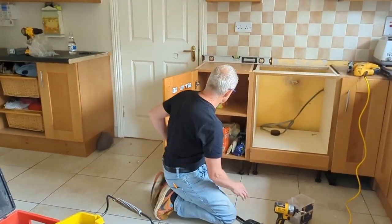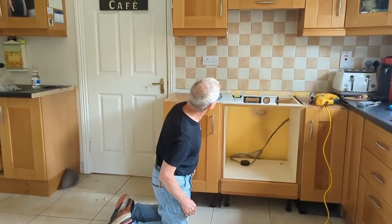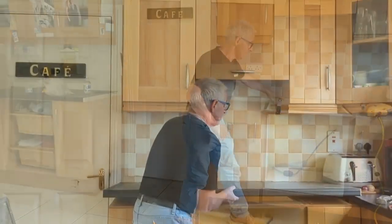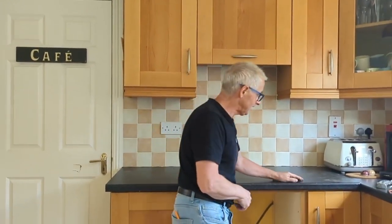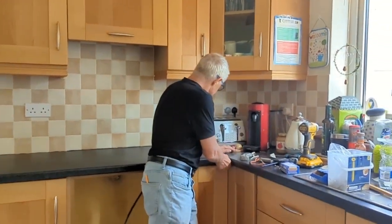That's my unit screwed together, everything's level. I'm bang on level in that direction and perfectly level in this direction — happy out with that. And I've got to push it in under the tile there, and it sits in — just about. However, there's a little issue: there's a mitre joint on the corner here, the original one, and I don't want to go altering that. However, it's leaving a gap at the back here of a full quarter of an inch, and that means the wall is out of square.